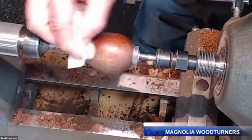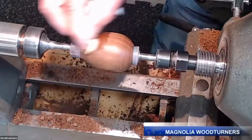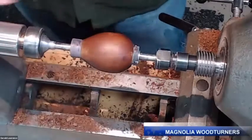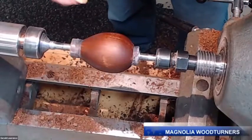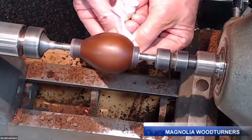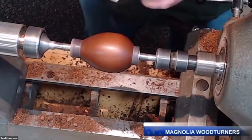You can see how it's darkening it up. So you wipe this on without the lathe going. Get a good coat on there. And then with that same section you just had, start rubbing. You see that shine pop out. Let's go back and forth. Again, I'm still at the same RPM here. It is a friction polish. And then take a clean section with a rag.